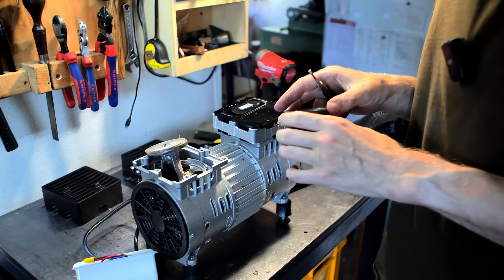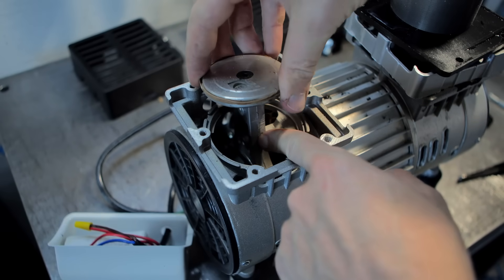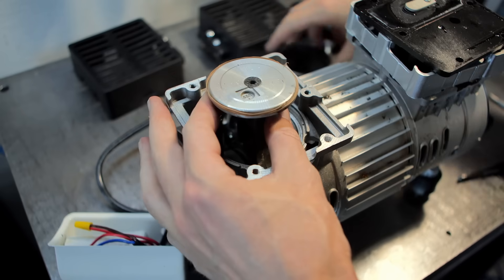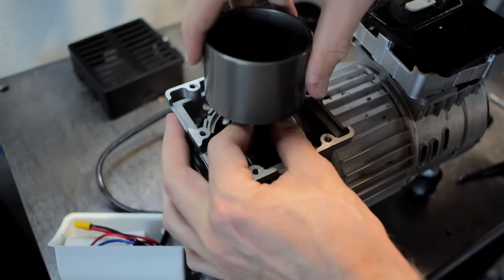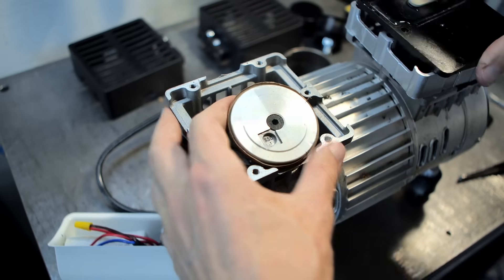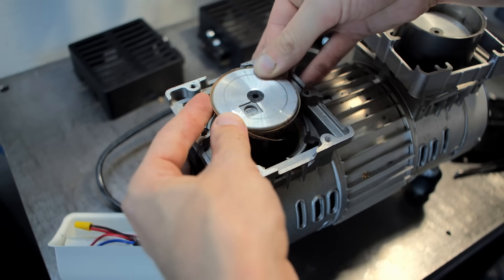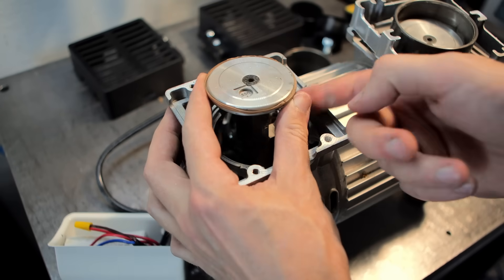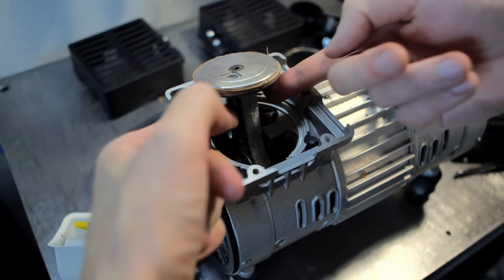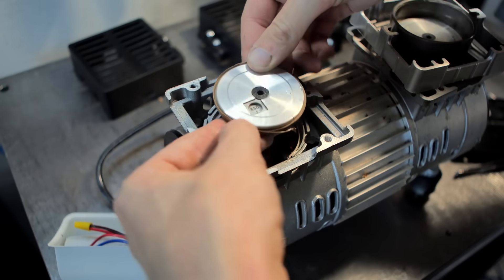Wow, these are primitive. This is the piston and it's mounted rigid to the connecting rod — so it doesn't adjust for the angular error, but they're sealing it with a single elastic seal. When it goes up and down, it's tilting back and forth — a rocking motion. Normally on a car engine you'd have a connecting rod pin to allow angular misalignment.